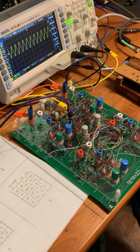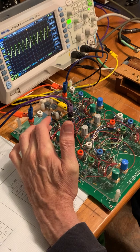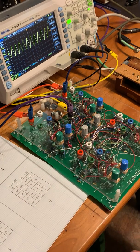Now, I'm going to talk about bounds modulation, which is a Peter Blasser concept, and I'm going to describe this more in my post about this on my website. Bounds modulation means what we're getting here is a typical oscillator. It falls until it reaches some boundary. Then it rises until it reaches an upper boundary, at which point a comparator reverses the direction.